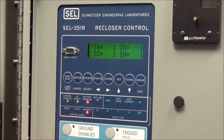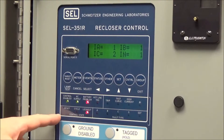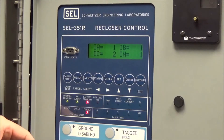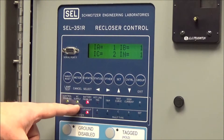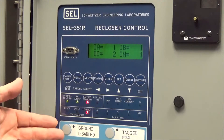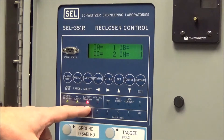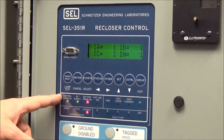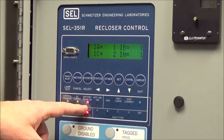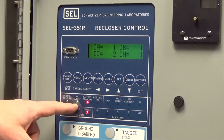The display LEDs on the controller are important as well. The control-enabled and AC lights indicate normal status — the controller is enabled and protecting. The AC supply light: if it were not lit, the controller would generally be dead or operating on battery only. The battery problem LED should not normally be lit. In this case the unit does not have batteries installed, so it's currently showing a battery problem LED.